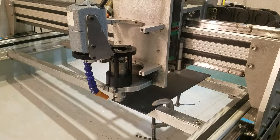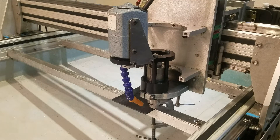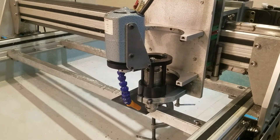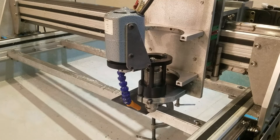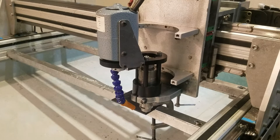I'm going to hit the 7 key to move it to the retract position. Now I'm going to go to the Y axis and repeat the same thing — backing it away from that edge a little bit, changing to the Z axis. Make sure you have plenty of light so you can see. The edge of that nose is just touching the bottom of the Y axis. I hit Y to bring up the Y control and it says minus 0.125, and I click set as listed. Now if I hit the 7 key to go to retract position, click the MV icon and move to 0,0, the center of the nose should be at the corner of the material.